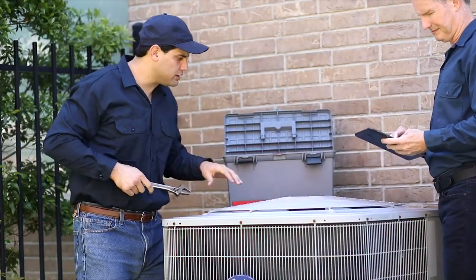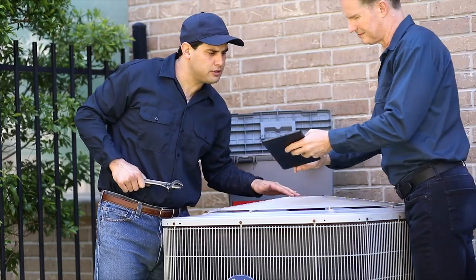In order for you to send a push notification to the homeowner, you must have entered your dealer ID on the S40 at the time of installation to connect the thermostat to your dealership on the service dashboard. Make sure you train your installers to do this at every installation.